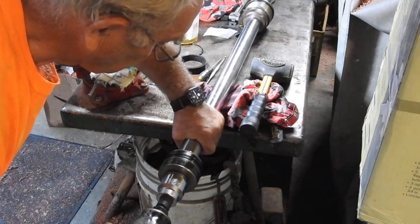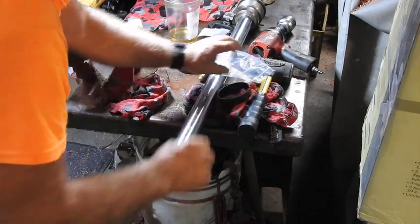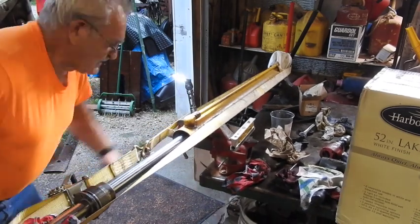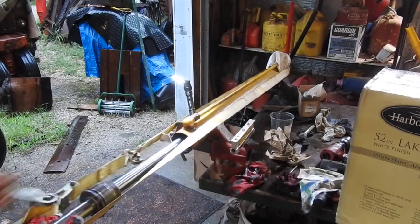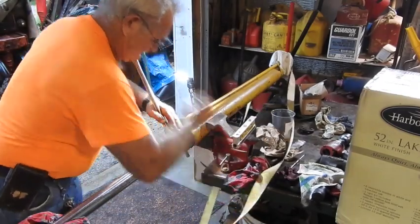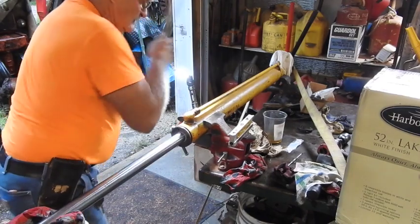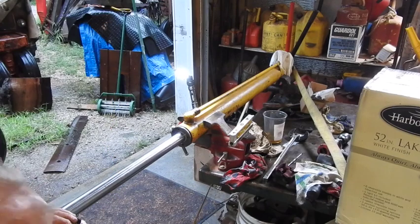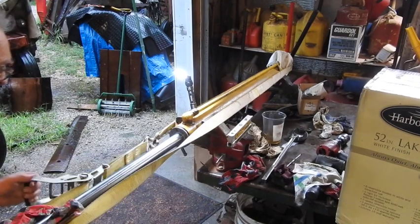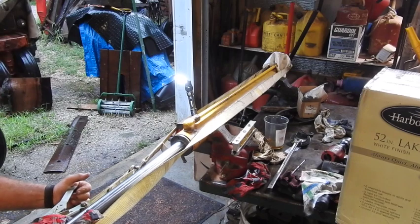With the entire assembly soaked in oil and reassembled, and thoroughly clean, you can thread this back onto here. That one last piece I just popped off — this guy right here has got to be replaced. I'm going to go ahead and put some lubrication in and around that. There are many ways of doing this and the professionals don't do it like this, I'm sure. I'm going to go ahead and draw this in a little bit. Now that we've got the packing gland on the end, I don't have to worry about it pulling in crooked — it's going to pull the ram in perfectly straight. On a solid table, two guys would probably be able to push this the rest of the way in.